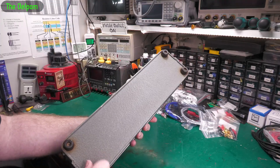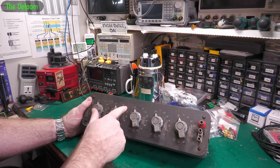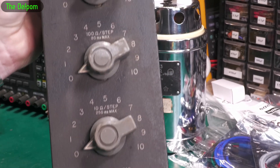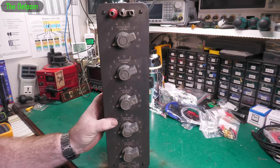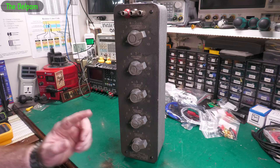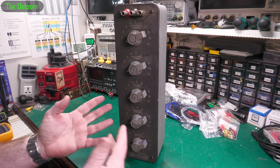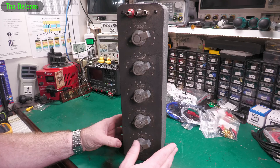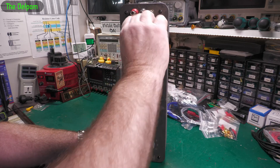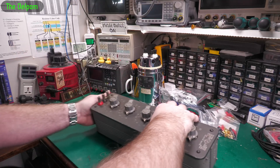This is the back of it with feet, and there's the front — dirty, it's just old grime. GenRad — this has been called General Radio — 1432P. So it's 10 ohms up to 100k. This is kind of a duplication of another one I've purchased, the 1433B which is a 6-decade and covers the same range. I bought this thinking I might need spare parts — if there's a bad resistor I could swap them around. It's relatively cheap. The dials feel gummy on some but fine on others. Let me stick a meter on it and see what we're getting — set to zero, 0.3 ohms which is fine, probably half of that is lead resistance.